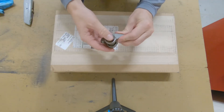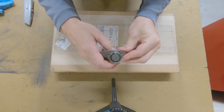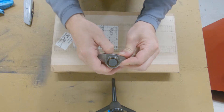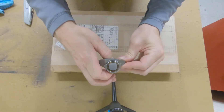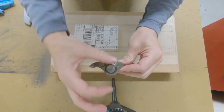I'm having some problems with these trunnion kits that I bought. The bronze bushings egged out. If I wiggle this up and down, push up on this, there's play — roughly ten thousandths. If I go side to side, there's very, very little, if any. Back and forward like that, but up and down is bad.